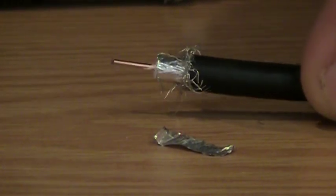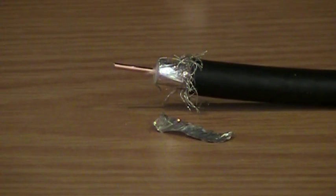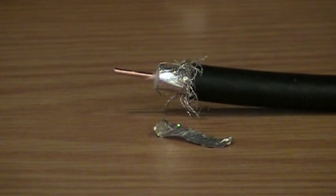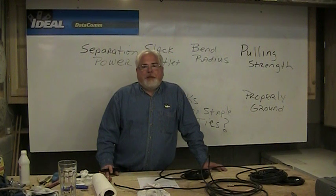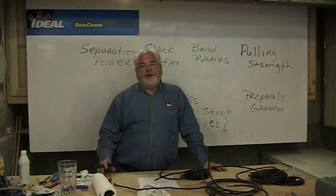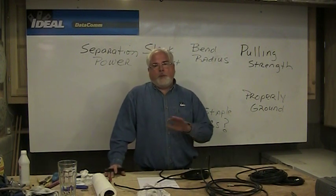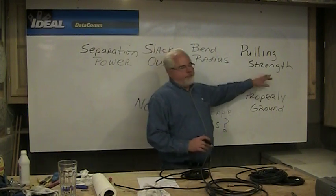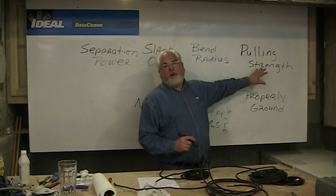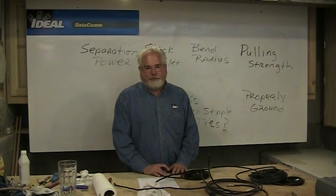We prefer to have a nice clean-looking strip where there's nothing on the center conductor. In the next segment we'll talk about how you actually install that wire. When you look at pulling and installing wire, one of the first things we've got to talk about is pulling tensions — the pulling strength you can actually apply to the wire — because if you throw several hundred pounds of weight against the wire, it's obviously no longer going to be the same shape or even the same gauge.